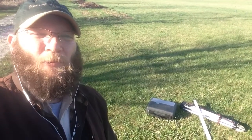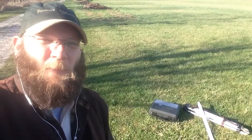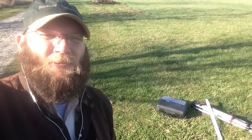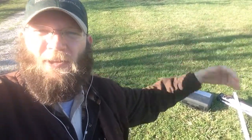Hi everybody, this is Rob with Deliberate Living Systems. Today's Friday April 10th 2015. We're back out here at York Meadow Farm where over the past week and a half we've identified our key point, laid out a contour line, and run two additional contour lines at one-foot intervals to the south or higher. What we're going to do today is set up the laser level and start running additional contour lines one and two feet down towards the northeast side of the property.